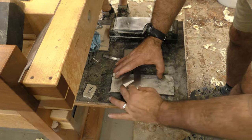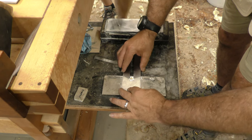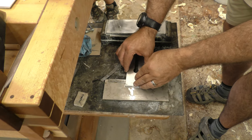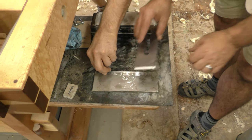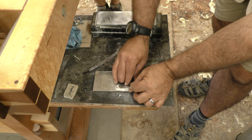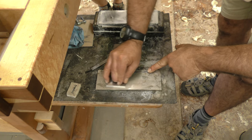Just moving the blade back and forth, putting even pressure on it, staying within a quarter of an inch of the edge. Why is that important? If you move back further, you're going to change the angle — you'll get a steeper angle. There's also a little bit of a cup in this blade, so if you flip it over it'll stay put a lot easier and won't rock around as much. So stay back and forth here, holding the ruler to keep it flat.